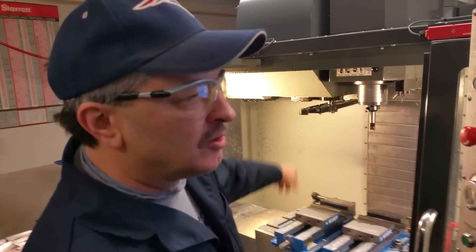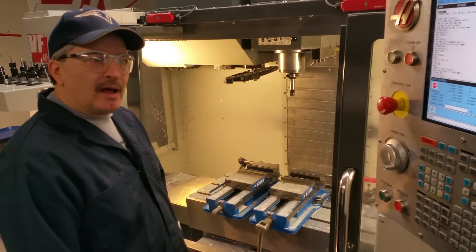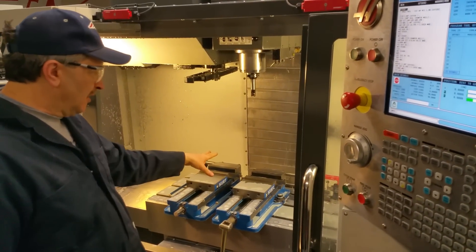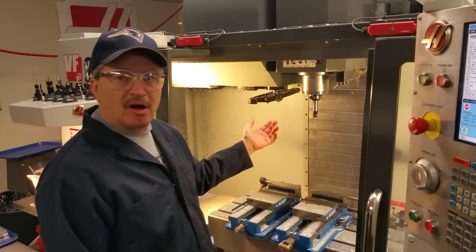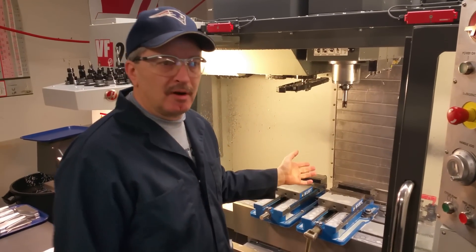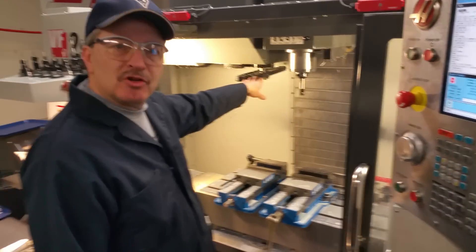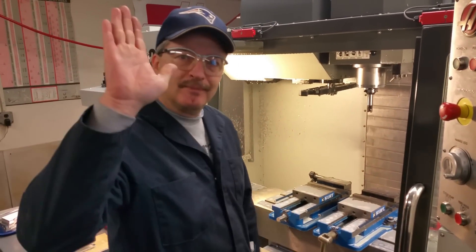There you have it — there's our test. The previous cycle with the two inch cutter including load and unload time was two and a quarter minutes. This is a minute, and it takes roughly 30 seconds to load and unload, so I gained a significant amount. That makes the cutter well worth the cost. The money I'll realize in savings on this job alone won't fully pay for the cutter, but it won't take very many jobs at that rate to pay for itself. When we get that thing shortened up, I'll definitely come back, do some more test cuts, and put some video online.